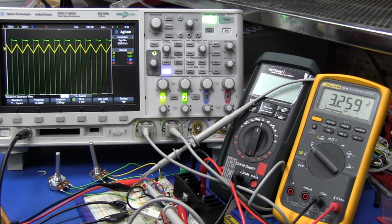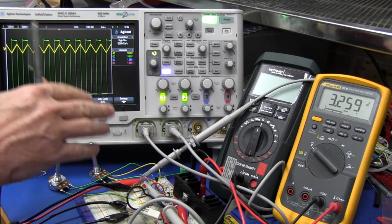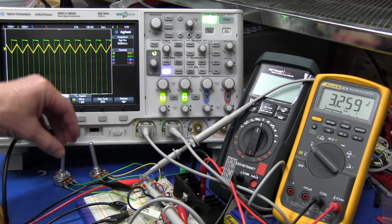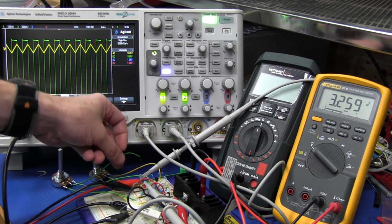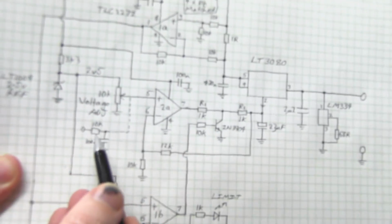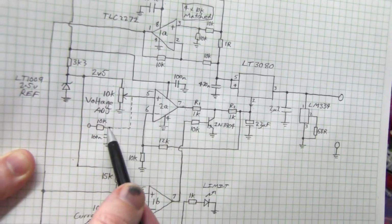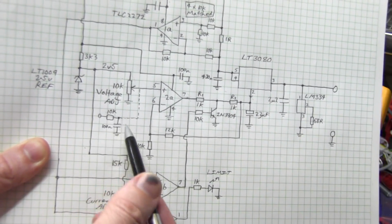Alright, enough of the simulation stuff. Let's actually feed a PWM signal into our circuit to replace the pot which we used in the previous videos. That's exactly what I've done. I'm using the function generator output of my Agilent scope here to replace the pot, and I'm feeding it in via a single RC filter, which is what we've looked at. Instead of the voltage control pot, we've disconnected that and we're taking it down to a 10K and 100N low pass filter, just as we looked at.